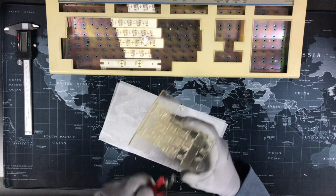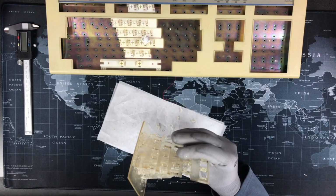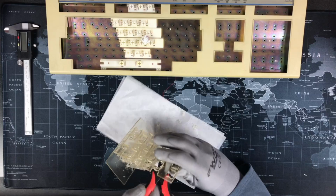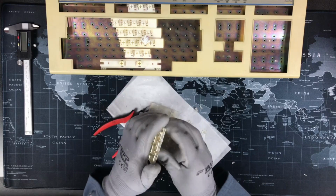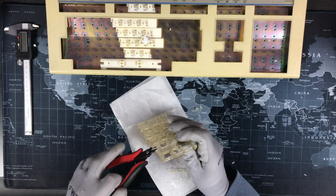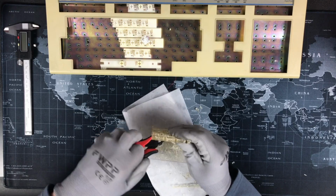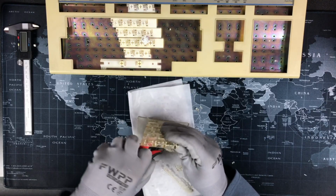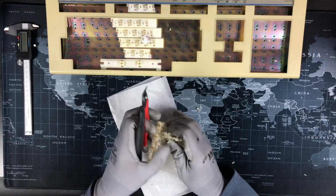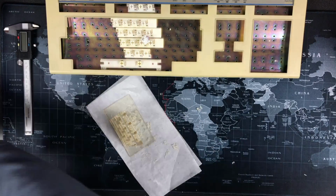Now I get it. Right near where they connect, the support structures go up, but at the very end where they connect, they're the thinnest. So I should be looking at this horizontally and trying to go in at this angle, flat, to shave off the narrowest part of those connections. So that part's looking pretty good. Lower here. Let's see if I can do this without breaking off my actual part that I printed.